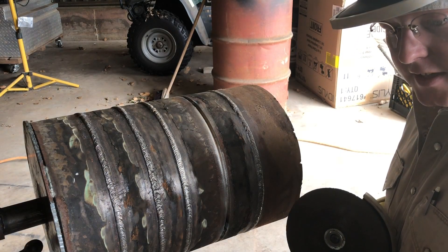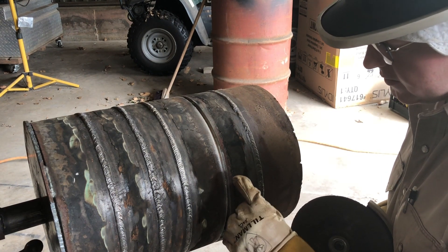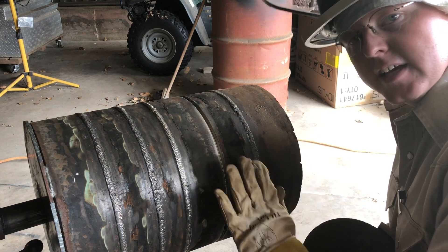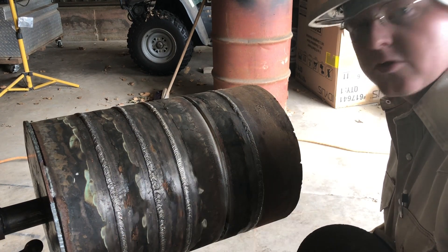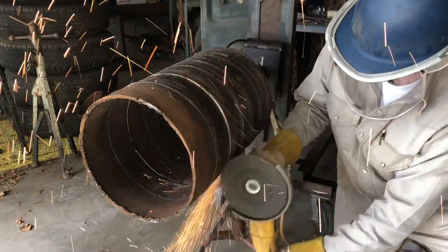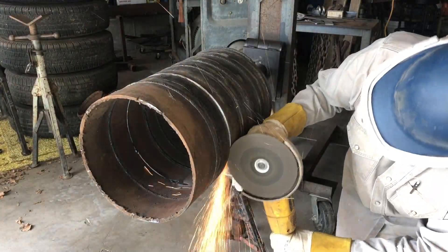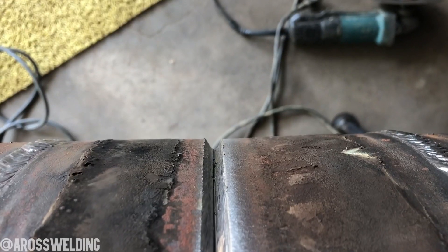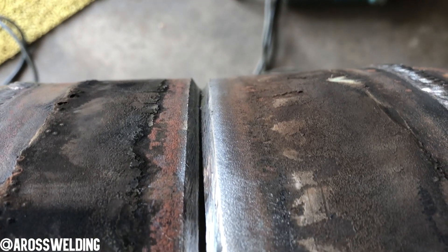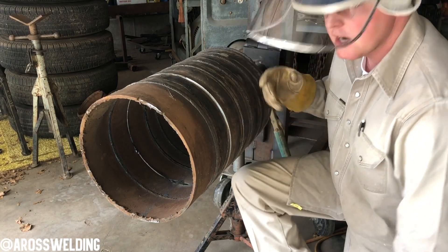When it comes to cutting, especially on thicker pipe, I like to go ahead and soften it so you're not having to cut as much with the zip disc. The main thing about softening is you just don't want to soften it too much. You are trying to make that landing thinner — like if it had a nickel landing, you're trying to make that landing almost nothing so they can actually penetrate it. That's what you'll do whenever they say soften the weld, so they can get that bead in there easier. Soften it and now we're going to cut it.